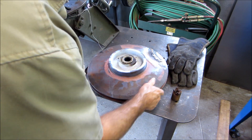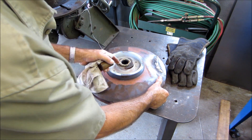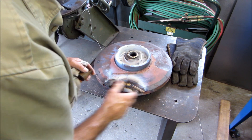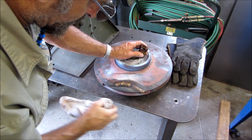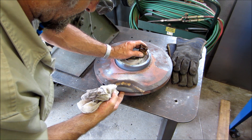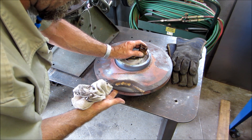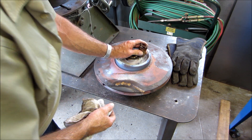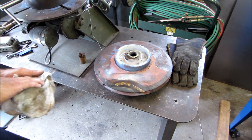And here's the back side — same thing, enough height. Here's our braze repair there. We've got plenty of material out here to dress that. We'll grind this on smooth. And we have one little dimple sticking through the hole that we prepped there. That looks good. So we're going to move this on out of the way so we can start playing with our grinder here.